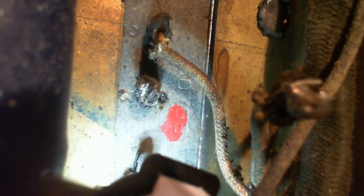Look at that. That's quite the mess there, eh? So who knows what wires have been moved around. Some of those, the snaky shape of the wires, the bending of them, looks like they've been forced there. Now probably the pin... Hey, wait a second. 1, 2, 4. This is 3. Hold on here. They've gone and fooled me some way. You see the number 3? Oh no. Oh, look at that. So on this radio, the mystery pin is number 3. And that's why this one becomes 4, and the pin I thought was 4 is 5, but it's the same as 4 without the 3. Everybody get that?